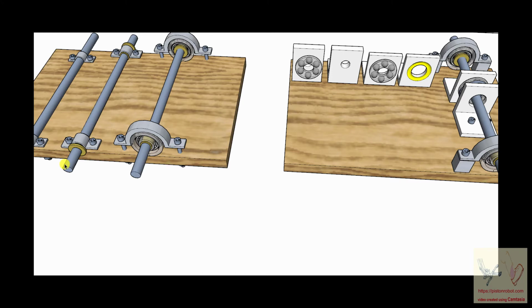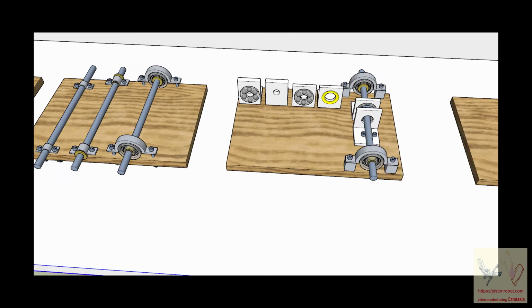Why is that? I don't know. I assume they used to have, for example, ships with a propeller on a shaft, and the propeller is pushing the water, but the way it's pushing the water is it's generating a thrust against this shaft. If you don't have a thrust bearing, then when you spin the propeller up, the shaft will go up inside the ship, up inside the motor, and ruin the motor. So while you do have to stabilize the shaft against radial motion, you also have to stabilize it against axial motion, and that's a thrust bearing.